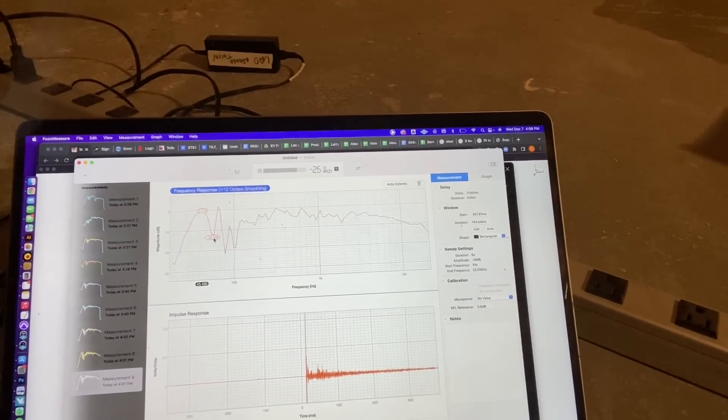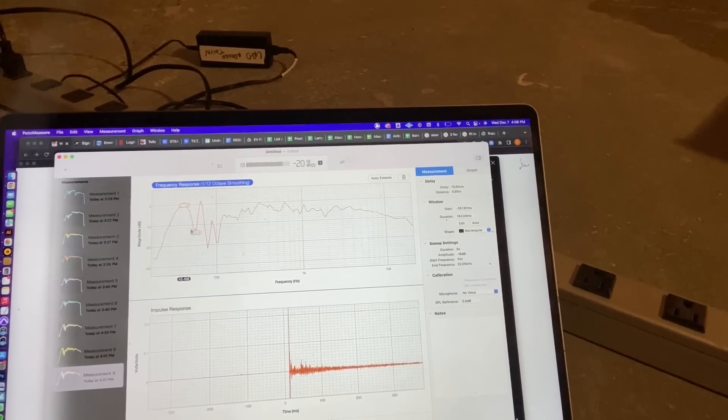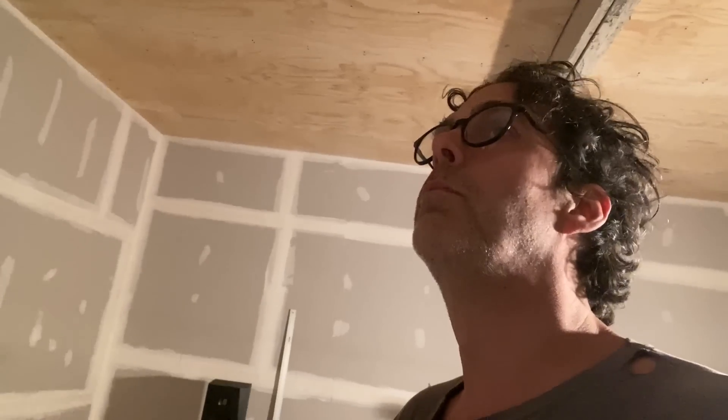This cancellation here is right at 60 Hz. If these panels work the way they're supposed to and it resolves this, then I'm probably good from there down. The ceiling is going to have panels built by Renz, a company in Germany — it was an unbelievable drama getting them shipped here. The ones on the wall I'm building from scratch per Juergen Strauss's direction. I'm covering any open space as much as possible with these custom absorptive panels. This is the last time I want to do this, so I want to get it right.